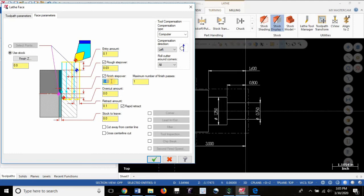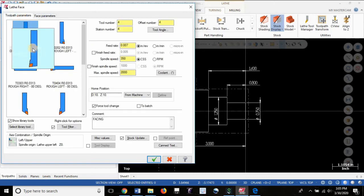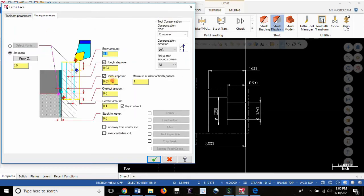Finally, we want to decide how deep the finish cut should be. The key thing is to get a number a little bit greater than your tool nose radius. In this case we had a radius of 0.0313, so I'll go with 0.033 for the finish step over to ensure a good surface finish. All I changed was turning on rough step over, setting a depth of cut, and determining the finish step over depth. I'll set that back to 30 thou for an easy demonstration, then hit the blue check mark to generate a tool path based on the parameters we've established.